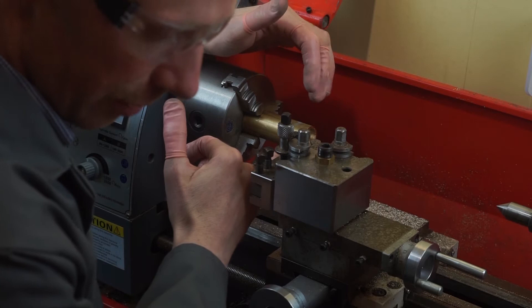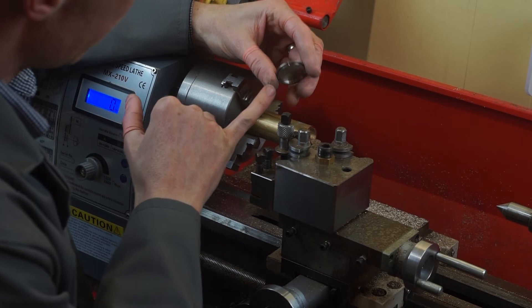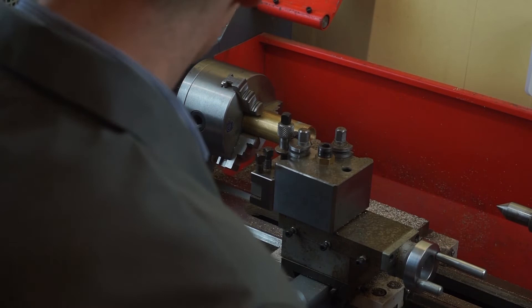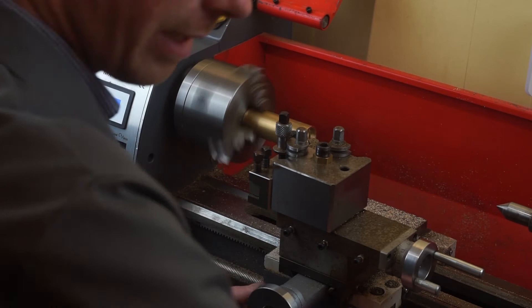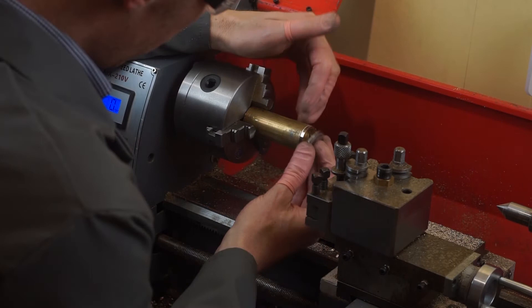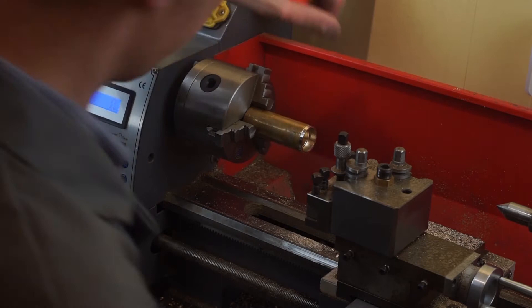I've now changed over to a cutting tool that's going to cut the outside diameter. I get one of the case backs here and I use that to measure up — I just find it quicker than using the calipers. I've also pre-marked the material at 3.35 millimetres, which is the depth, and I'm going to go in towards the chuck. I'll just go quiet while I make that cut so I don't have an accident. I take small increments off until the case back fits. It needs a bit more off so I'm going to make another cut now.